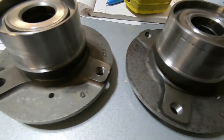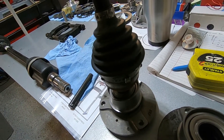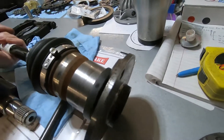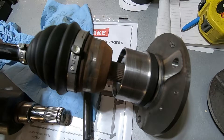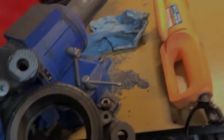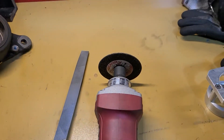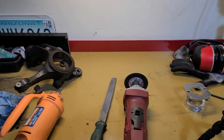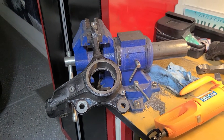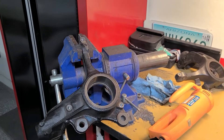I got both of the rear hubs machined out. They'll fit the front. I've got to bore out the front hubs using a laminate trimmer with a carbide bit and an electric die grinder — earmuffs and gloves required. But this is a first project that nobody's ever done before. These parts aren't available, so I have to modify them myself.